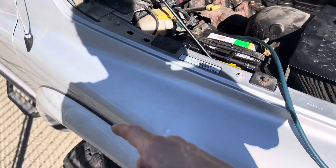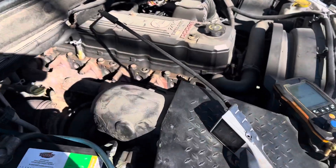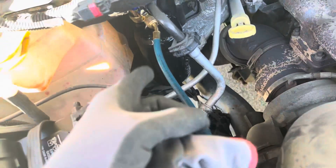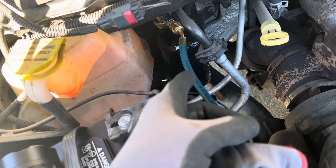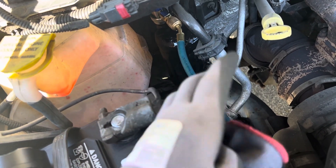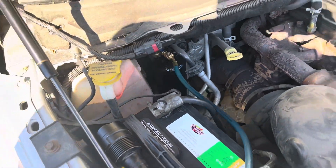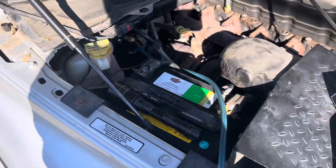We are back on this Dodge with the Cummins diesel engine that had the leak at the accumulator. That only leaks when the metal is basically cold. It barely leaks when it's warm and high pressure, but when the pressure drops and the metal gets cold, it leaks like a freaking bus-size hole in the side of a Hoover Dam.